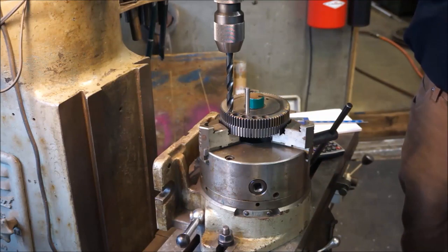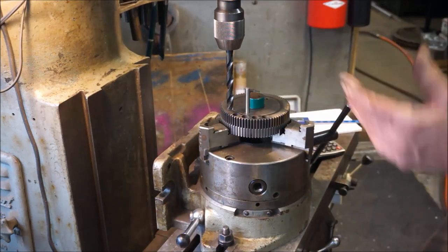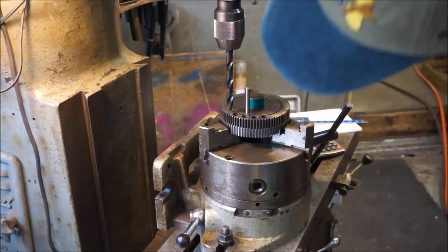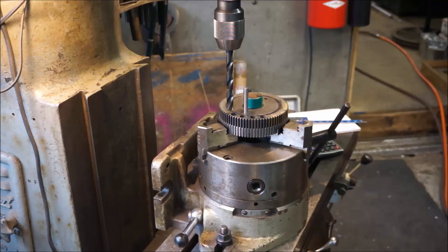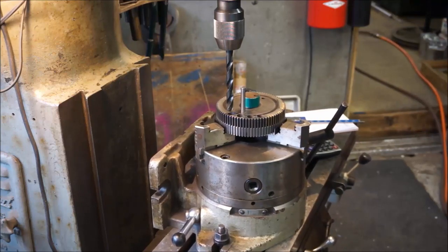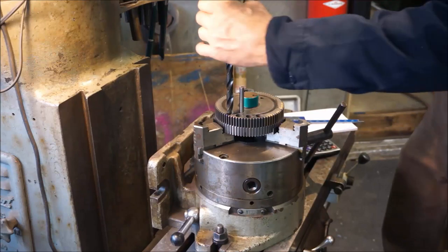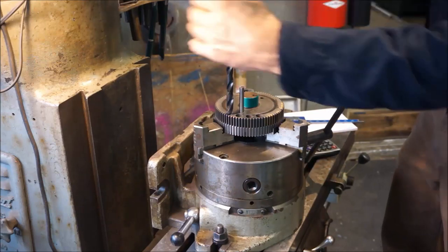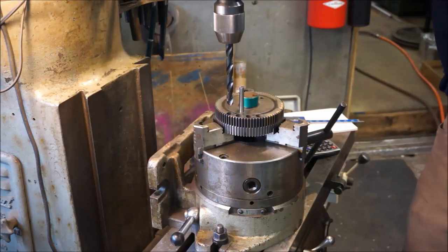Now this drill point that I have and the drill point down in there, I didn't put nothing down in there to find exactly what that drill point is. They look pretty close by eyeball, just glancing in there. Okay, now we come back to our 0.627 here. All right, that's where we were. We're still happy. Okay, now we come all the way down here and we are 320 thousandths on the depth.